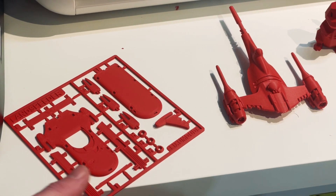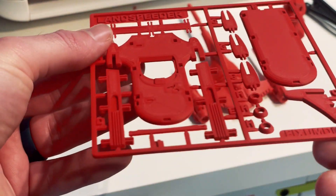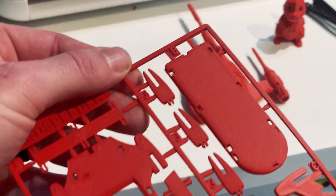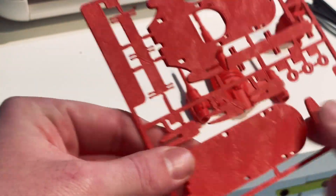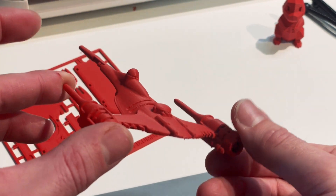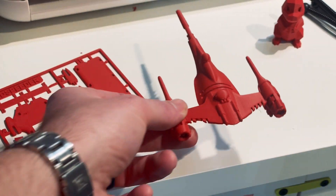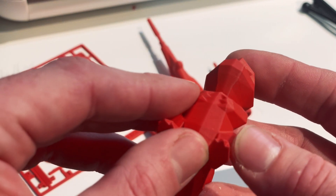The print quality has been exceptional since I got it dialed in. This is probably my favorite model printed on it so far — this Landspeeder kit card with lots of neat little details. I'll link the Thingiverse file in the description below. This is printed at 0.16mm layer height with pretty low infill, and I got a really great first layer. This Mando's Naboo Starfighter printed out okay — this was before I got the belts tensioned just right, so you'll notice just a little bit of layer differences. Once I got it dialed in, this low-poly Charmander came out great with minimal variance in our layer lines.